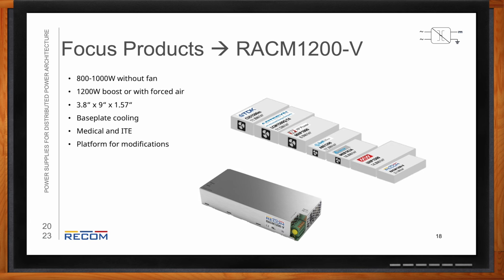you can change or apply a conformal coating, and also PMBus for programming some of the internal specifications, like holdup times, things like that, as well as integrating it into your power system to make it a little more of a smart system and work together better. It's again high efficiency, 95%, which is very attractive for energy savings, as well as limiting heat generation.